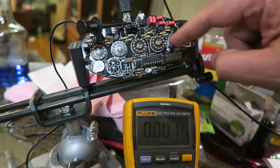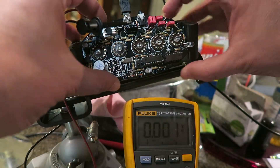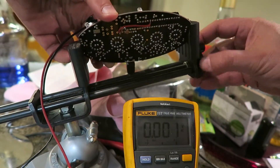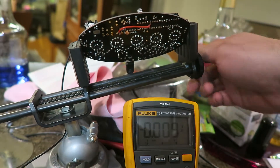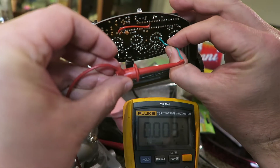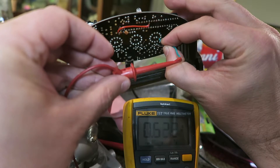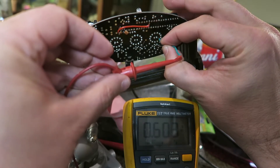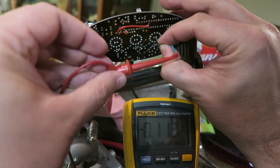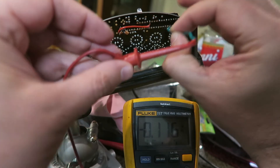You also asked about this particular diode — I'm pretty sure that's the one under V4, which is diode 5. Let's rotate this fine vise and we can take a look from the underside. This one here is at 0.5 to 0.6, fluctuating the same way as the other one. The one on the other side is about negative 0.1. Hopefully this helps.